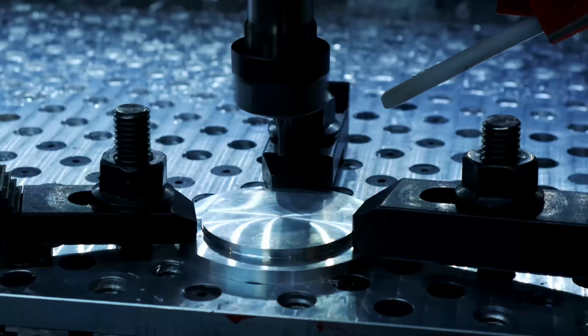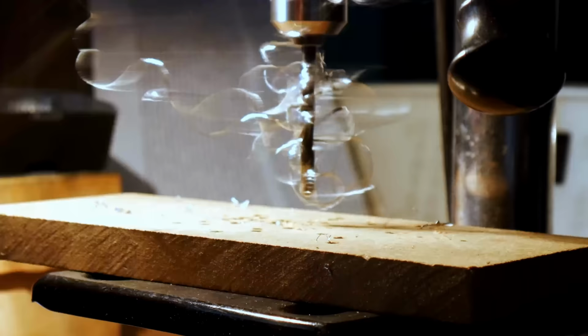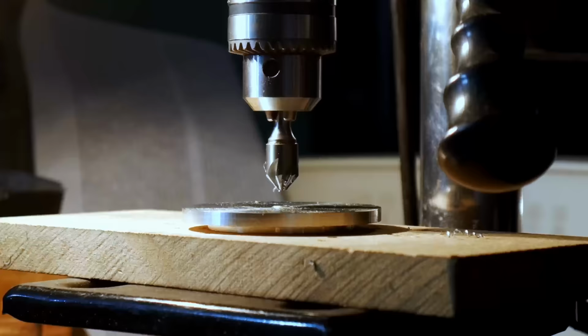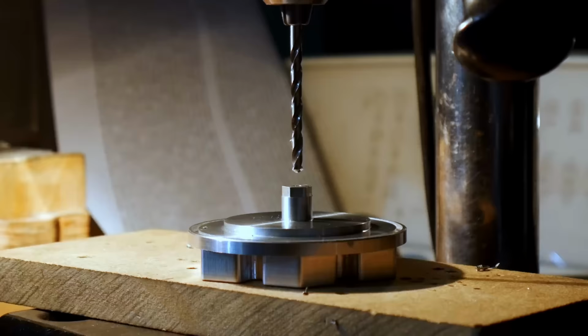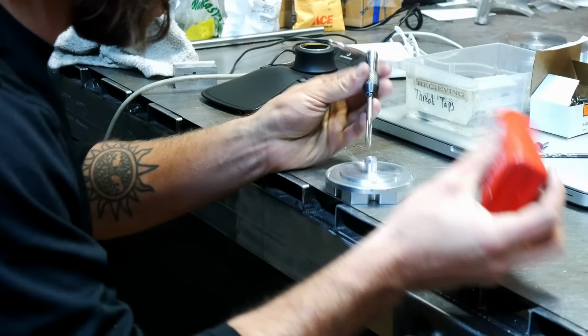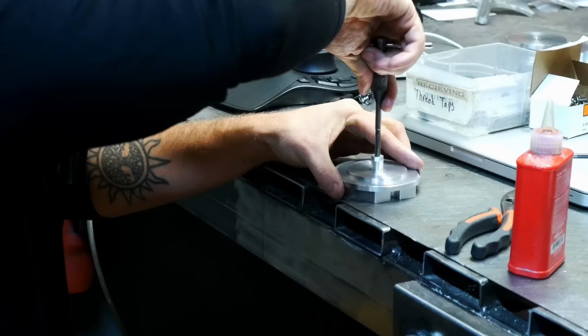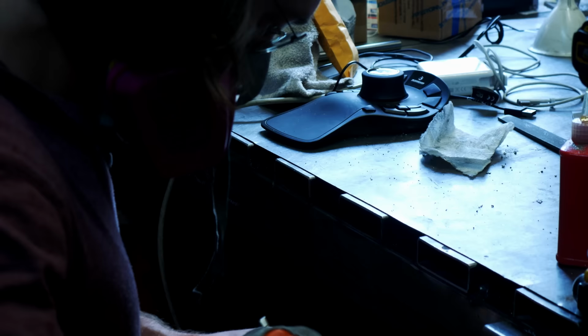So here we're gonna do the other side of that locating fixture you saw earlier. So this is the back cap for that fixture. It was very quick, I know, but it was essentially a hex that fits together, and the screw holds from the back, and so I needed those not to unscrew, so I needed a fixture to keep it from twisting. It did end up having a little bit of backlash in it because it wasn't a very tight fit, so I ended up having to put a little bit of epoxy in there, but it did work. With the epoxy, it worked. And here I am tapping that screw for that same part that holds the two together. And you'll see it later when it starts to come together.